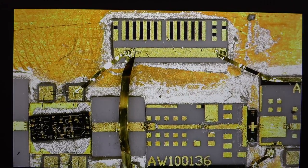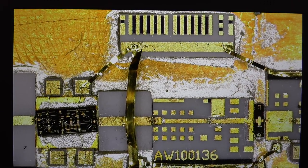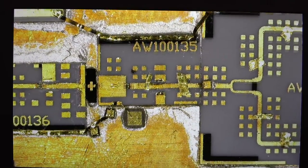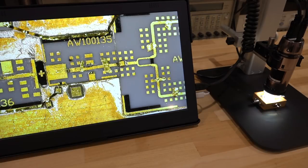All of this would very easily integrate into an integrated circuit depending on the power handling capability — gallium arsenide, gallium nitride, phosphide processes can easily do this, as well as silicon germanium. Very nice design and very nice microscope. I really like this one and it's definitely the one I would use most often in my work — especially because I don't need a computer, I could just have the monitor on the side. At this magnification, we're sitting basically right on top of the module, so you can't do any soldering at this distance — it's just for examination. I do believe there is a long working distance version of this microscope as well, which wouldn't do 220 times magnification but would certainly be useful for soldering applications at a slightly further distance.